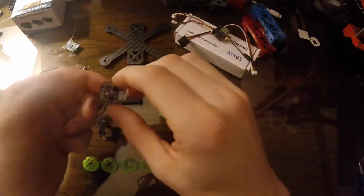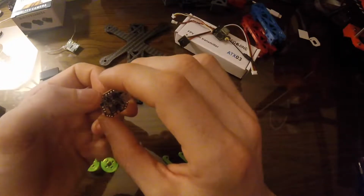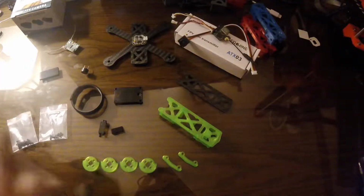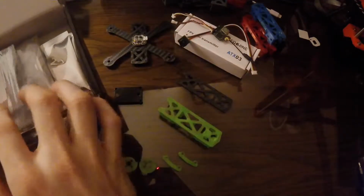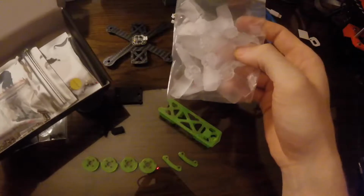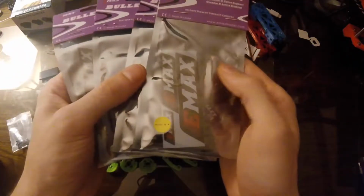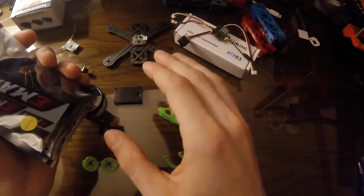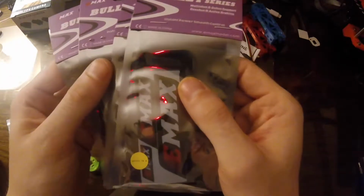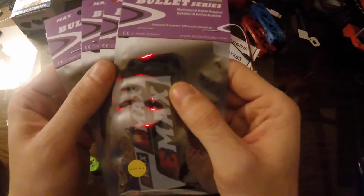I'm not really familiar with any of the other 16 by 16 millimeter mounting hole ones, but you could maybe give those a go too. And this Emax Micro Power System kit, I think they're just under $70 from Emax. You can get the Femto, a bunch of screws, 2 sets of propellers, 4 6-amp ESCs. These are okay to use on this build, but I would definitely recommend upgrading them to at least 12-amp ESCs.